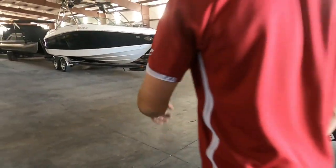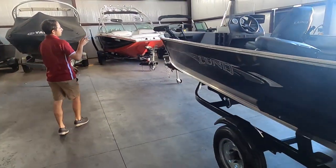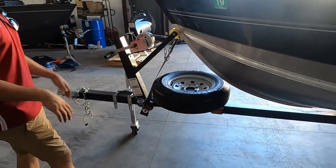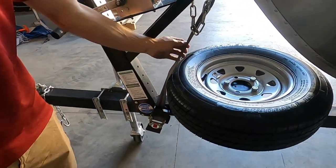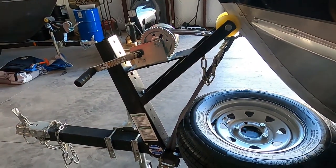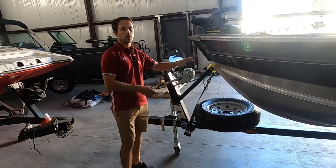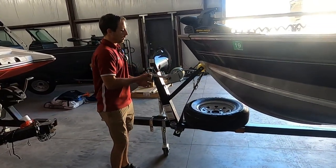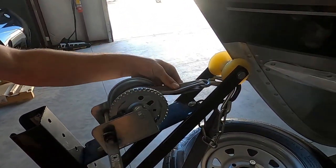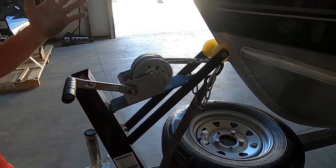Moving over to the bow of the boat and going over the trailer a bit more — this trailer has a secondary safety strap, so it's actually got three bow straps on it. A little overkill, but it's better to have too much than not enough. This strap and the chain are going to be your two safety straps — remove those before you back it down the ramp. Once the motor's fired up and you're ready to pull it off, the very last step is to remove the bow winch strap. To do that, take a lift up to relieve pressure, get the little switch here, flip that down, and now it's free and ready to unlock. When you go to put it back on the trailer, flip your latch back up, twist to lock, and that's good to go.